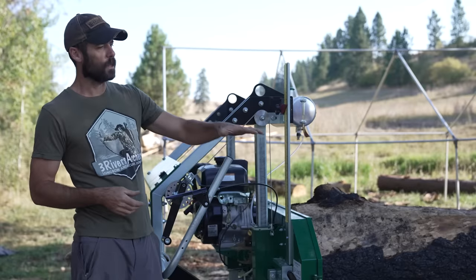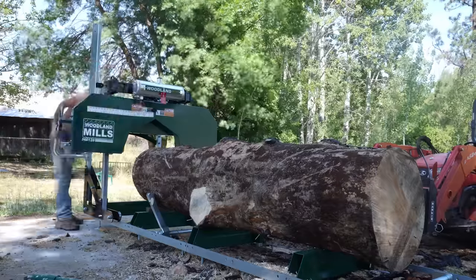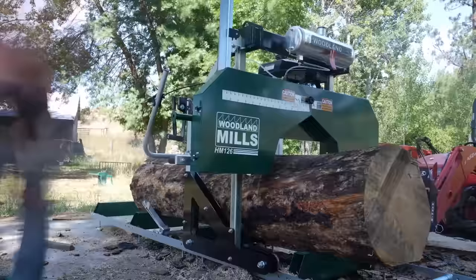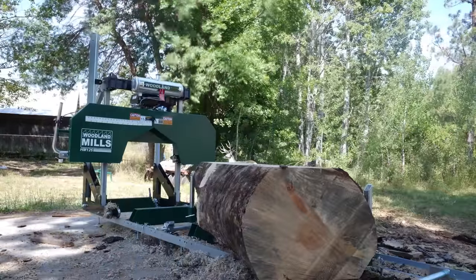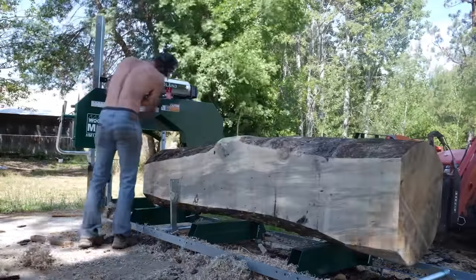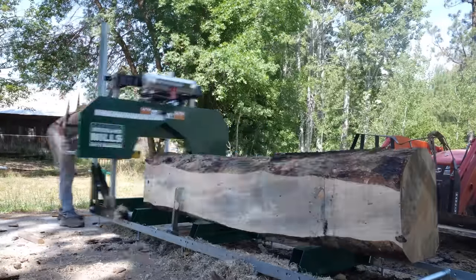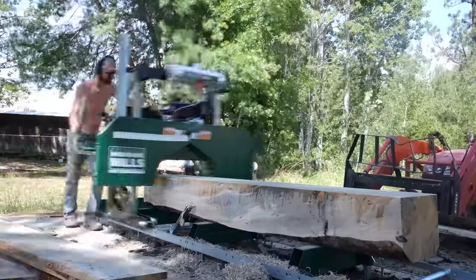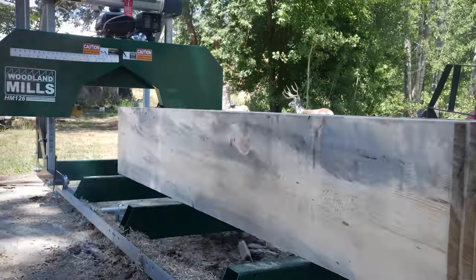I've also cut a lot of paneling over here. We've got some pines that were killed in a wildfire several years ago, and the wood boring beetles are getting into them, and they've also got this blue pine stain. The combination of the Swiss cheese look of the bugs with that blue pine stain makes for a very cool looking board. I've been milling those about a half an inch thick, and that's 2.5 cranks on this thing.